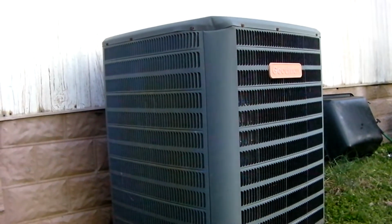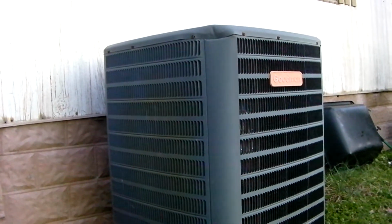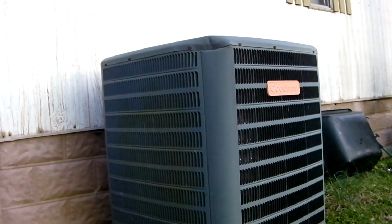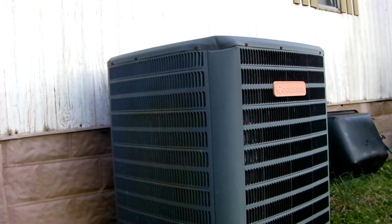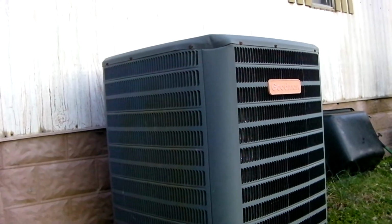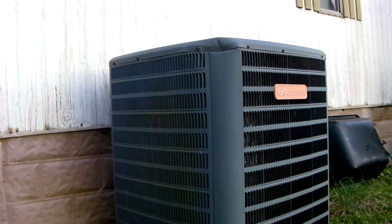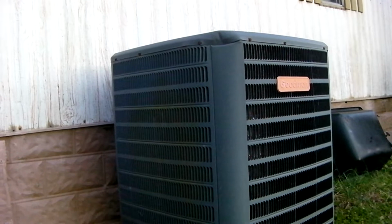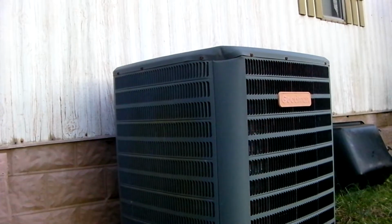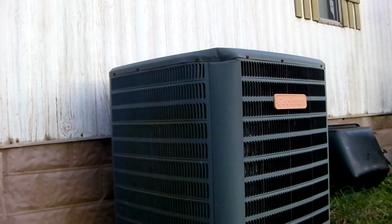Because I tell you, back in early 2017, when this thing was still using time temperature defrosting, and I didn't have the wood stove at the time, just a fireplace, which I don't think ran much that day, it was a cold, cold day. We actually had snow on the ground. It was cold outside. I think we had a low temperature of like 13 or 16, something like that. Well, this thing was set to 90 minutes on its time temperature defrost control. It made enough defrost cycles to where the daily electric usage for that day was like 74 kilowatt hours, which is quite a lot. On average, I use about 15 kilowatt hours if I'm not heating or cooling, so it gives you an idea.